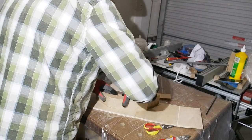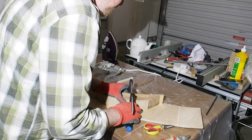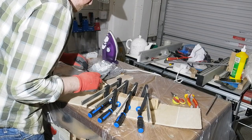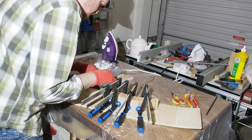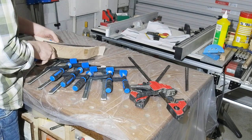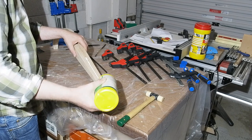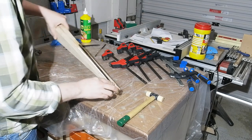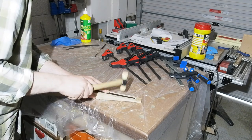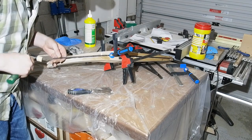For the form, I'm using one of the waste sides from cutting the curved top pieces. This won't give me an exact curve match, but that's not necessary — I just need enough of a curve to help the inlays take the shape when glued in place. This needs doing pretty quickly and making sure the pieces are in the right orientation. A bendy ply rip gives me the clamping face. Next day, unclamped — a nice bunch of gently curving blackwood. Ideal. Around the curves I did clamp where pieces connected to minimise the risk of any funny business.